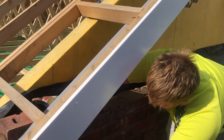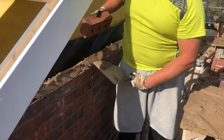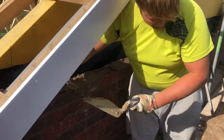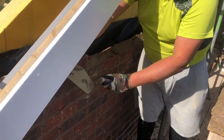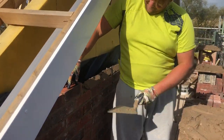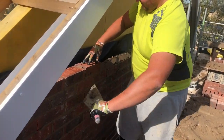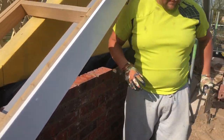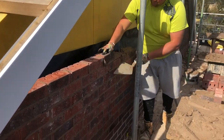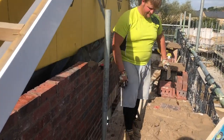The idea is to always tap and clean cavities on a flat start so hoddies can get in front and load up for a couple of hours. You do lose a little bit of time, but the cleaner you keep your cavity trays and ties, the easier it is. On my next plot I'm going to leave blocks out over the upstairs trays so I can access them — little step ladder inside, climb through the hatch, clean my trays over meter boxes, knock a couple of bricks out. It can take 15 to 20 minutes to clean your trays if the accessibility is there, then 20 to 30 minutes tapping tie wires. You can be ready for inspection in an hour.